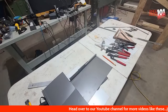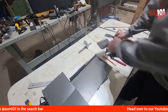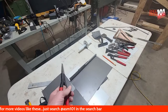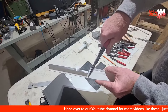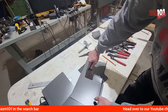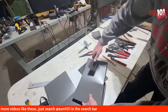Okay. So instead of having the cool tool, maybe you don't have one of these. Maybe you have a spade chisel, a lot of guys carry one of those. Or grab your needle nose. Even just normal needle nose will work. And on that line, just take it and twist it on that line. Put the chisel there and just start the crease. And a little more.